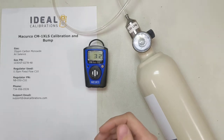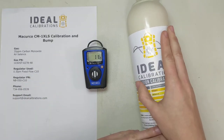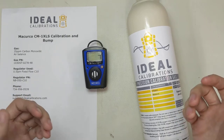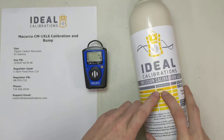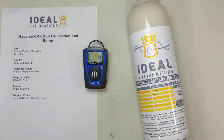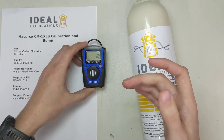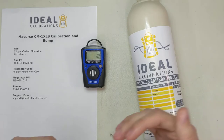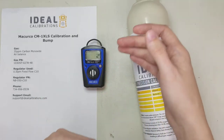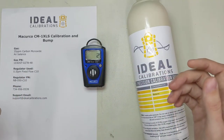We've got a bit of an issue with this unit — the bump test takes a lot longer using your calibration gas. Usually you'll want to use your cal gas cylinder to do your bump test as well, rather than buying an extra cylinder. But in this case, because this is 35 parts per million and the monitor's alarm set point is also at 35 ppm, when you go to do your bump test, you need to see confirmation that all the alarms are going off. That's what you need every day before you go into the field — if something has happened with the alarm, like the vibrating alarm or the horn getting clogged, if you don't send it into alarm, you don't know that.